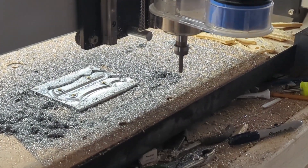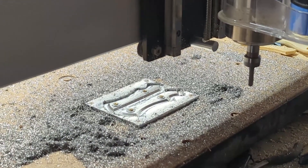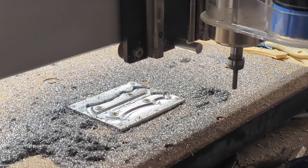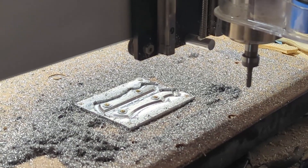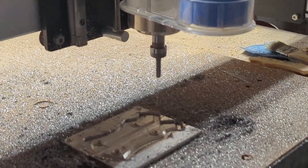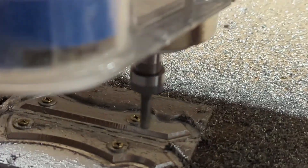I didn't get to narrate over the chamfer, but I used the 90-degree V cutter, which was an absolute disaster due to vibration and chatter. So now we're going to scoop out the little thumb radius with this quarter-inch ball end mill, and hopefully that goes a little bit better. Every one of these operations has a pucker factor to it.